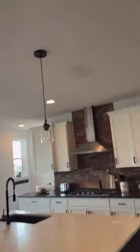After you're done shooting the texture, let it set for about 10 to 15 minutes before you knock it down. You could use your regular putty knife to knock it down — I personally like to use that magic trowel, it gives it a little bit better finish.